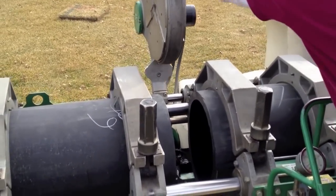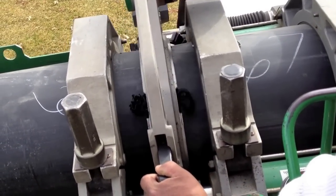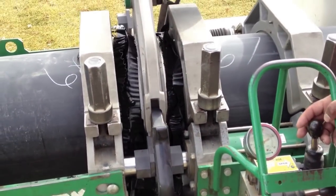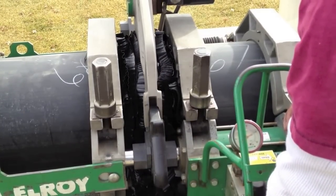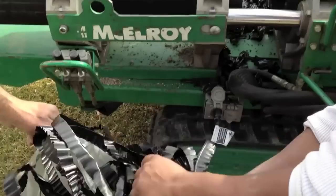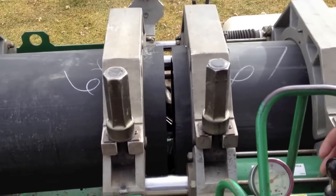Here's the first part of doing it. We got two pieces of pipe here and what we're going to do is we're going to bring those together. We've got a series of knives on both sides that kind of shave this and get these pipes exactly square. You can see the shavings falling off right now. Once they're squared, the shavings are done. Pulls the pipes apart, grab the shavings. Now we've got two pieces that are nice and square. Now we'll test those by bringing them up together to see how it looks.